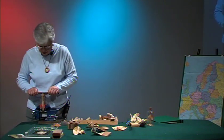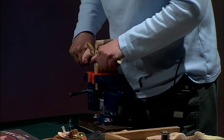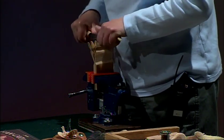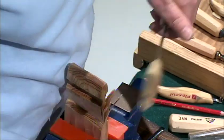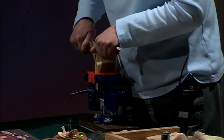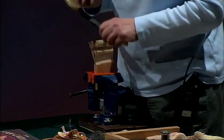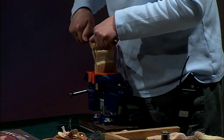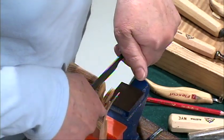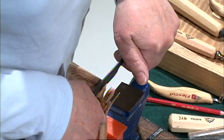If you've ever split wood for kindling, you put your hatchet in and you see that rive line go — this is doing the same thing if the wood were dry. But it's got enough moisture that the rive line isn't happening naturally; I'm letting it go with the knife. If there's a little wave in the wood, I let the knife go with the wave. It's just like making curls with a planer, except vertically. It's better to go thin, even if you lose some, than to go too thick. When you're going thin, you can feel what's happening. You've got a good quarter inch to half an inch here that's all going to come off anyway, so run your test and see how it feels. This is a good rive line, it feels like — just keep on going.